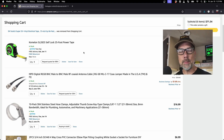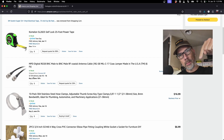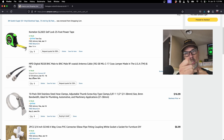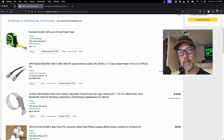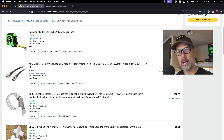What you need is a cheap tape measure. I put in this BNC pigtail, but in the description down below I'll have links to all of this stuff, and I'll include a PL259 pigtail and a SMA pigtail. The SMA pigtail is pretty cool because it's male on one end and female on the other — you cut it in the middle and then you have whichever cable you need for your radio. I did mine on SMA, but you'll find that out later anyway.